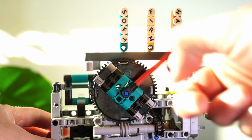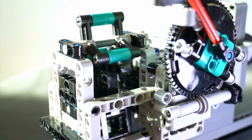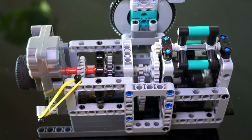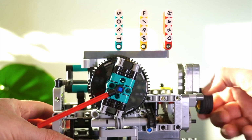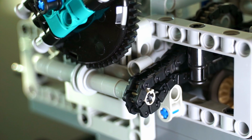And it's got this thingy, which is like a clock, I guess. And the rest is pretty much the same as our big boy. The escapement here is made of three rotating thingies, so we get three tick-tocks per rotation, and it's got the same 1:25 gear ratio. The way it works is you crank the wheel, which feeds the timer, and this belt then drives the worm gear, which rotates the clock face.